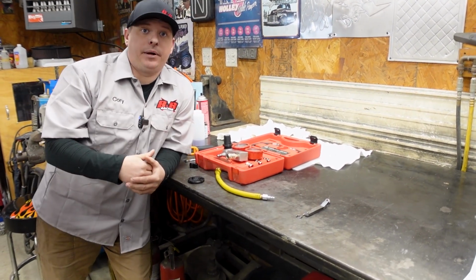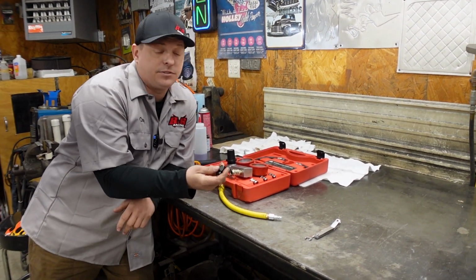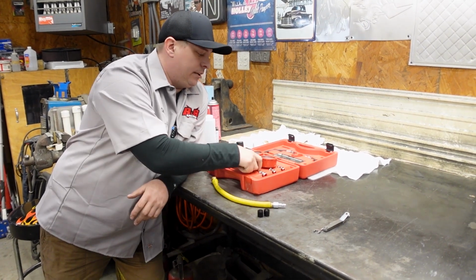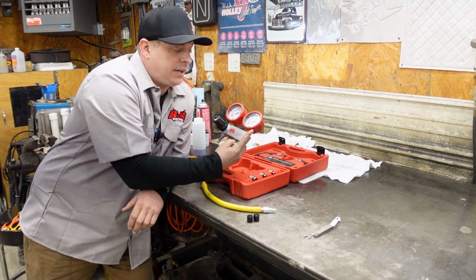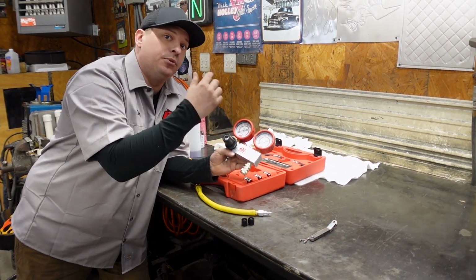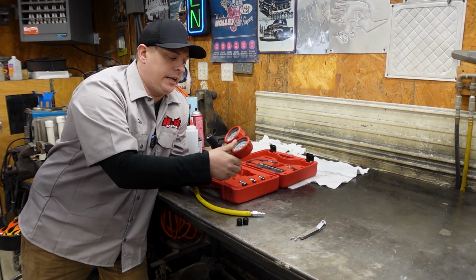After that, we gotta set up the barrel valve, and what you have to do there is plug off your 2 returns, at least in my case, 2 returns. You put this on the supply, and then you have to have a leak down tester like this. What we're going for is at 100 PSI, we want 25% leak into the motor. That's how much fuel is getting in the motor at idle. So we're gonna go over to the truck and get that done.